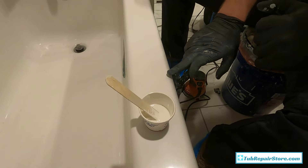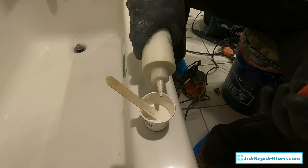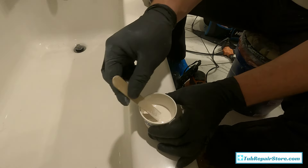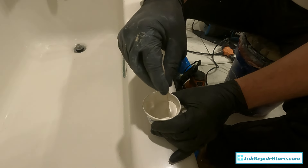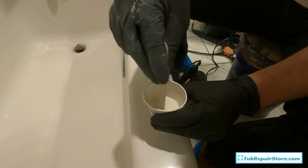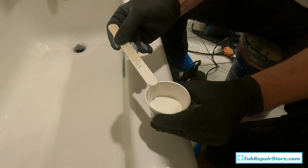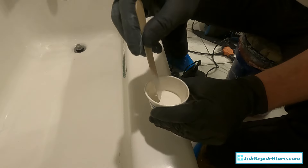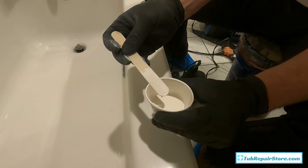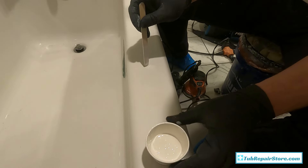That one is just a little light, so I want to go back with a tiny bit of gray white — not much at all. Take your time when you're matching this; you don't want to bounce back and forth too much, it'll just add a lot of extra time. Keep in mind I've got that glass putty setting up, so I have plenty of time — only about 15 minutes in. Take your time doing this color matching and get your color prepped while the glass putty is setting — that's going to make the project go quite a bit faster.